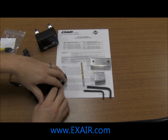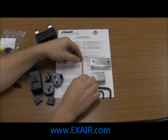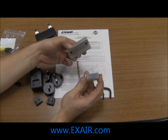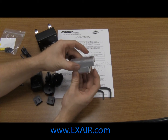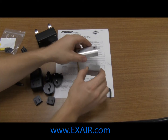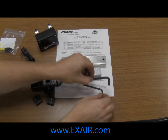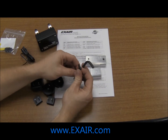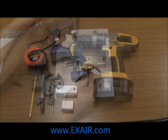The drill guide kit consists of a drill bit of the given post size, two guide devices to clamp onto the pipe to align the holes to drill into the pipe for the meter, and then two different size allen wrenches which will coincide with the allen bolts on the meter for the installation.